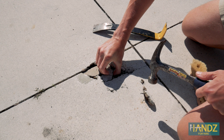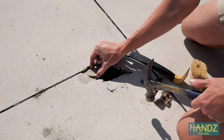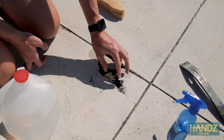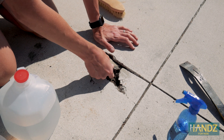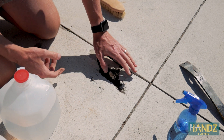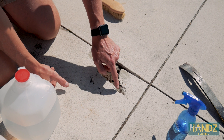If you don't get all these small pieces out, they'll continue to wiggle. I'm going to get in here and remove the pieces that are really loose. Now that I've removed the loose concrete, I've left the pieces that are really solid. These are pieces we're going to actually adhere to — we're going to use a bonding agent that's going to help us attach into the existing driveway.